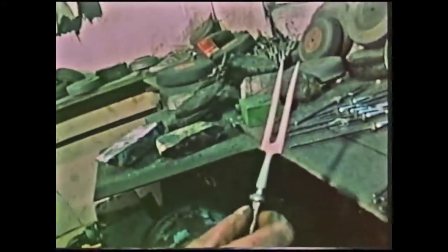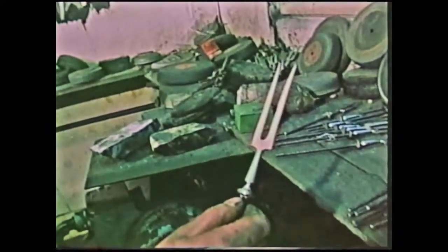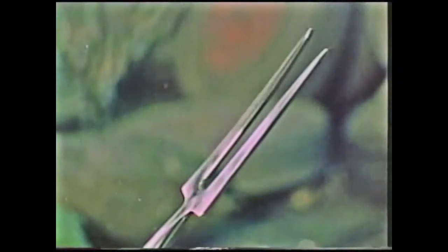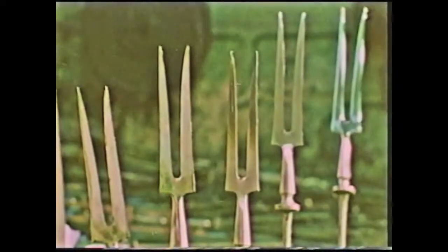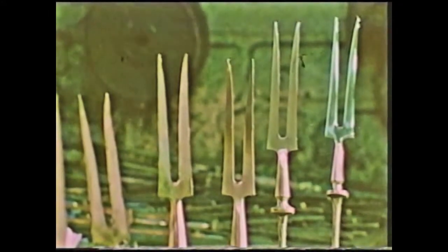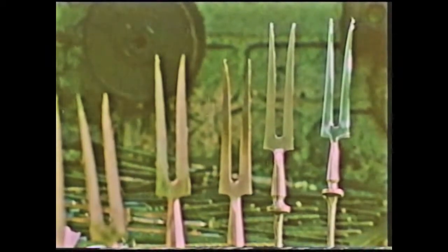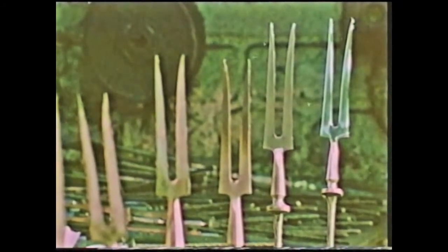And then the last process is a calico dolly. On this, we lay a finishing compound and lay it lightly on, and this brings it up to a final mirror-like finish, after which it's delivered back to the warehouse, to the place from whence it first came. It's inspected, wiped over with clean dusters, and set aside ready for the big firms, the cutlers, such as Viners, Mappin and Webb, Richards, etc., to put the handles on, put it in its case, and it is then a final finished article.